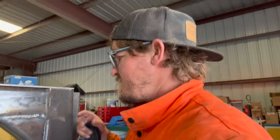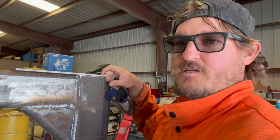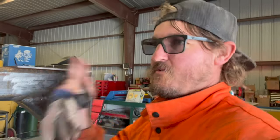1966 Navy trailer. So whatever they designed that one for. So I'm gonna put this quarter inch plate on the outside to be able to space this a little bit so then everything on that cross member is sitting flush on the trailer. So we'll go ahead and weld this up.